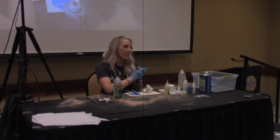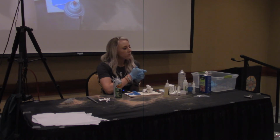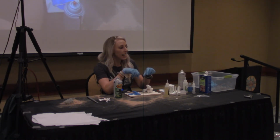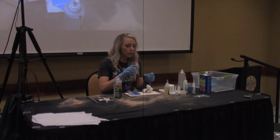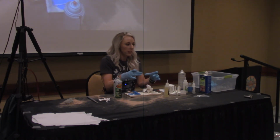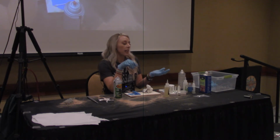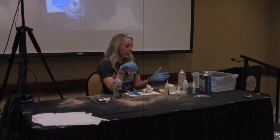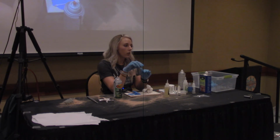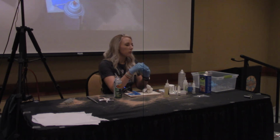It's not ideal. Yeah. So how do you get it flush with the top of the tube then? Okay, so I have from Harbor Freight the punch set, and it's a bunch of little metal rods. They come in a variety of sizes in this little kit. I'll take my Jacob's chuck on my lathe, and I'll stick in whatever size I need. If I need something for a really large pin kit, I will make sure to get the really large punch, because if you use one that's too small, it will not work as well.